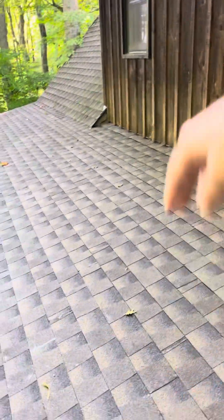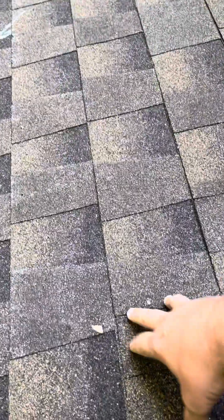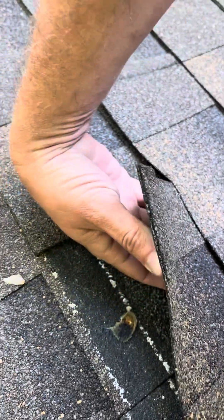This roof is very shallow — it's a 1/12, right? So you can see that's a low-slope roof, and we've got water coming off here splashing, hitting this roof and splashing. So it can go in — hit a union like this and splash. The water can splash underneath here where it meets, and it can splash left as well. Juan, put one little dab of silicone right there. I want to see that dab run all the way down to protect this union so that anything that splashes or moves isn't going to get a chance to go right or left where these shingles meet.